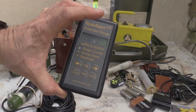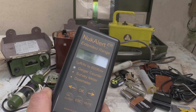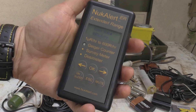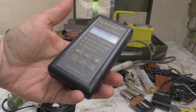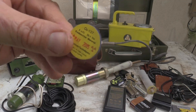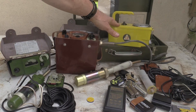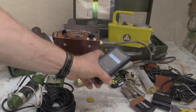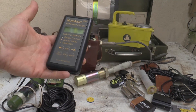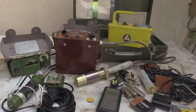This is a product that Shane deliberately built to combat the fact that you cannot use small electric handheld meters for high level radiation. What you heard it going off on is this little disc of cesium-137 - a tiny little disc used to calibrate these machines. This will do both high level and low level radiation. They use a government-issued cesium-137 machine, and there are actually very few of those civil defense calibration machines left in the world.